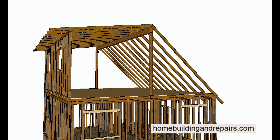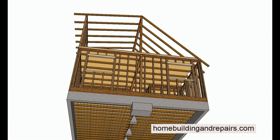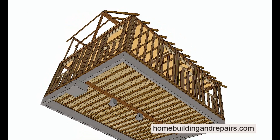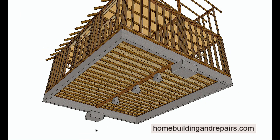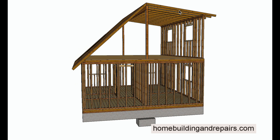These are only examples. If you had an attic that was only 16 feet long, something like this would probably work fine. If you had one that was 50 feet long, it might require more structural support. Any time you do something like this, I recommend getting a structural engineer. I've seen people make modifications to a house and then sell it — and it becomes the next person's nightmare. If you do use a system with posts and beams, it is going to require something that transfers all the way down to a footing. You will need to install a new footing most of the time, and it could require additional concrete work in the center.